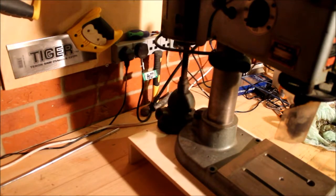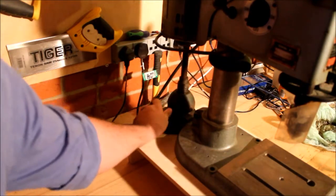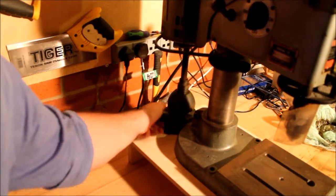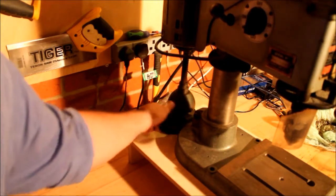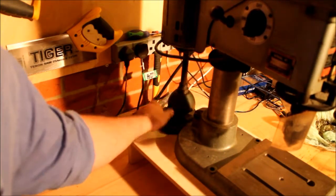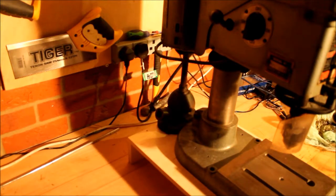The jack doesn't quite fit on the back of the wooden template, so I'm going to have to extend out the back very slightly. Short term, the plan is to put a big cog on the side so I can adjust and manage it — you can see it just lifts it off the back at the moment but it does raise and lower off the crank. Long term, I'm going to get hold of a motor, connect it up, and have it controlled on a switch. The screw jack is ideal because the only forces are vertical up and down. In this video I'll show you making the base and joining the jack to it, and in other videos I'll show the drill platform and further modifications.